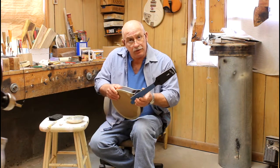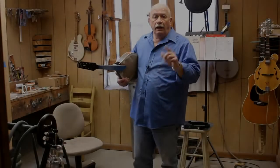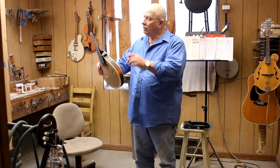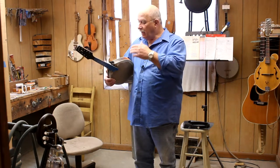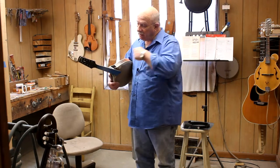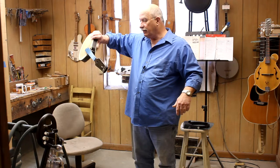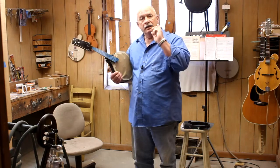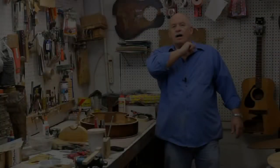It is Friday and the work week is rapidly coming to an end. Here's a situation report on the A-style repair: I've shot all the build coats on it, just got through doing a 220-grit level sanding, and shot yet another coat on it. We'll start in on it Monday morning with even a finer grit sandpaper and maybe another slick coat on top of it. Now let's go take a look at that older Gibson guitar.